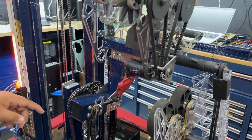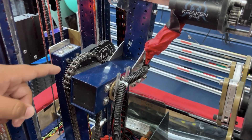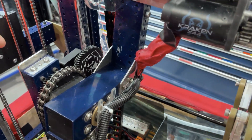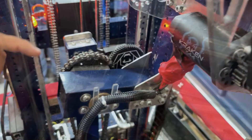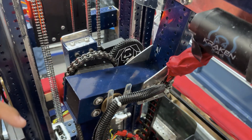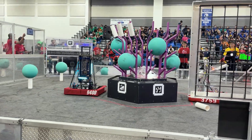In the 2024 off season, we had issues with positioning of our pivots. So you can see here there are two herringbone gears, and these herringbone gears are attached to a West Coast Products thru-bore encoder. That thru-bore encoder helps us figure out the position of our pivot at all times.